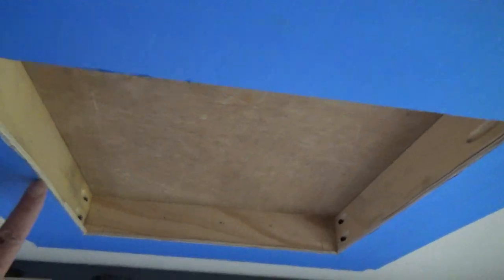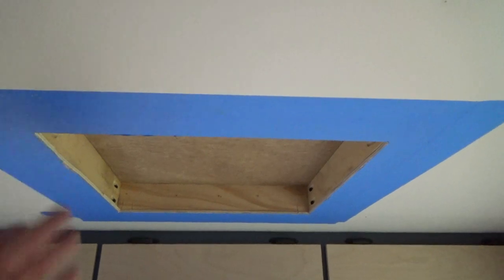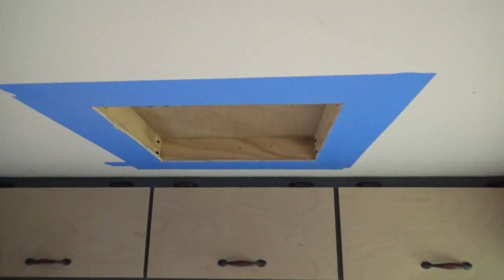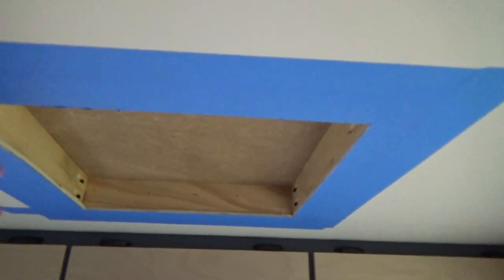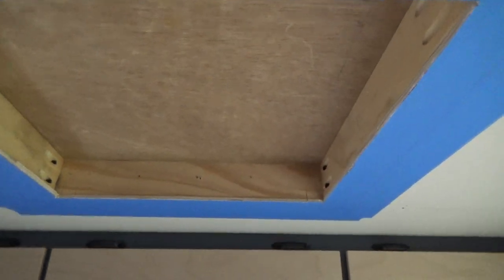We have the hole cleaned out, marked where we're going to cut, and cleaned out the foam insulation on the sides. I added an extra board on the front so we've got a nice inch-and-a-half bite. I put inch-and-a-half by two inch on both sides and we've got 14 inches distance here on each side. I'm going to run a router around this edge real quick to clean that up — I know nobody will ever see it, but I want it to look nice. Then I'll go ahead and punch a hole to fish our wires through.